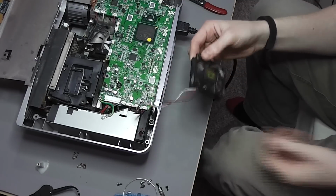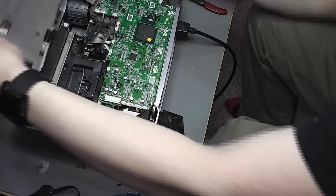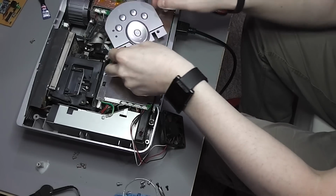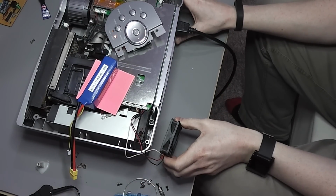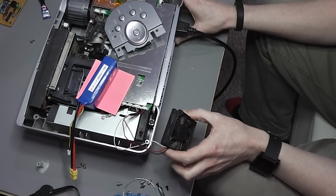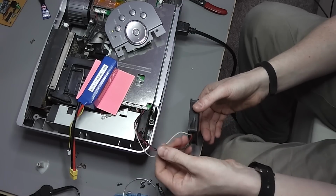So I'm going to try switching over the red and the blue and see if that helps. Connections have been switched. Let's try again. Let's fold this back first of all. Got the panel with the status lights, and trigger the switch. Same again, annoyingly. So it's supposedly got 12 volts across this fan now.